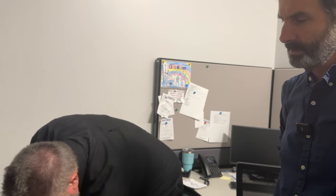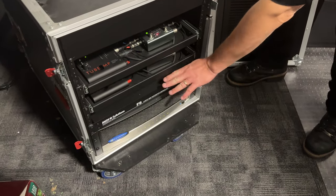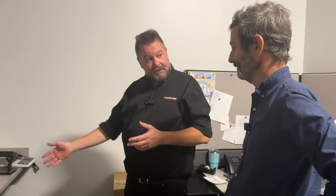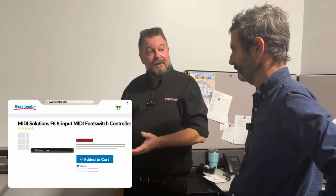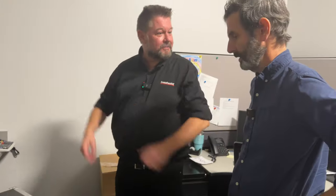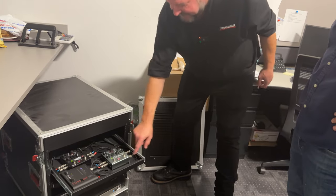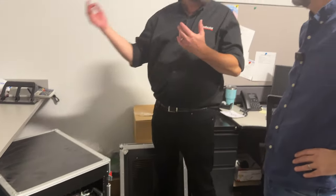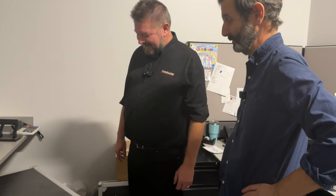Underneath it's exactly the same setup again — a Ventris and a Nemesis going into an eight-channel amp. In the back I have a MIDI Solutions unit, a single rack space device that takes switch closings and converts them into MIDI commands, sending MIDI program changes to the Ventris and Nemesis to select the large, medium, and small room presets. Same engine settings with different times and EQs. It's been running for almost two years now and everybody loves it.